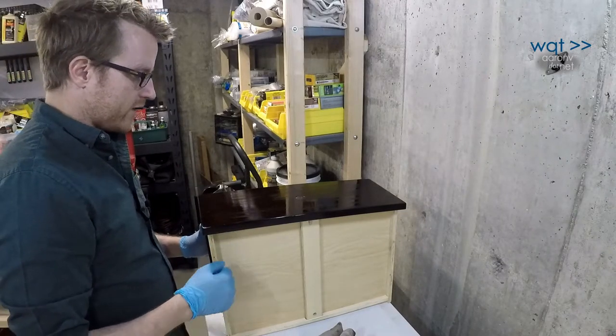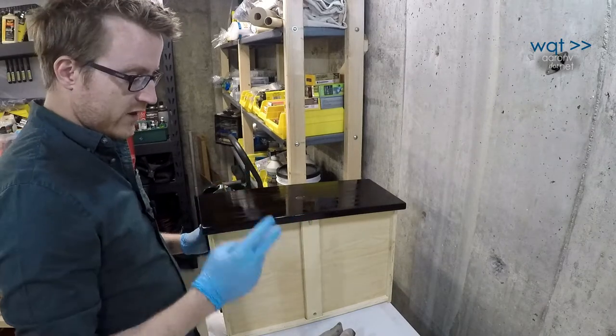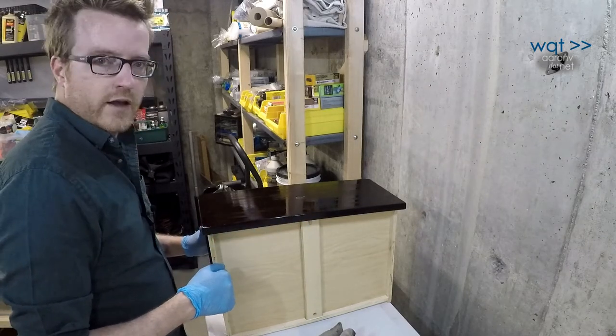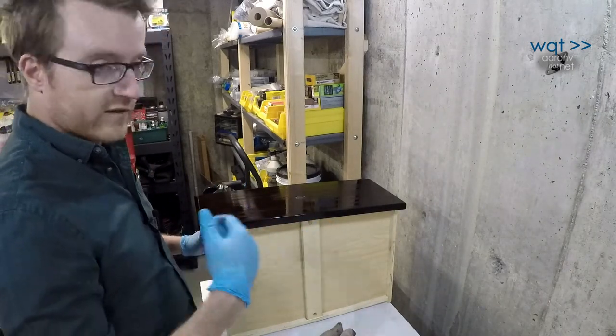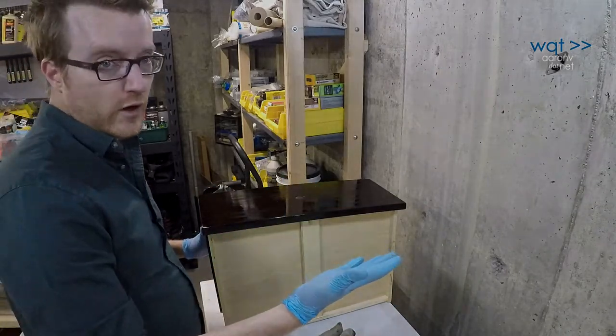If you've got something like oak with a really deep grain and you want to preserve some of that, two very thinned coats, three at most, is all the further you're gonna wanna go. Once you get to about five or six, if it takes you that long, you're gonna end up with a gloss finish. Now that gloss finish will be fairly waterproof, just like a hardwood floor. So that has its advantages, but it depends on whether or not that's the application and the look you're going for.